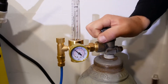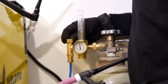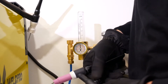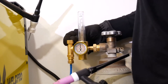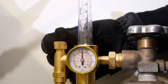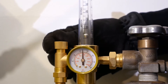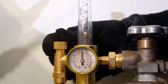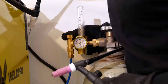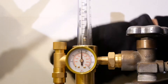On any high-pressure tank, it's important that you open the valve very slowly — we don't want to shock the flow meter. With the valve on our flow meter closed all the way, go ahead and open the valve on your torch, then open the valve on the flow meter slowly. You'll see that the flow begins to increase through the torch. I'm going to set this to 15 cubic feet per hour, then turn your gas valve back off.